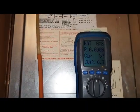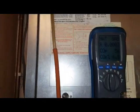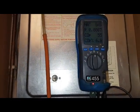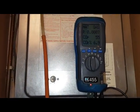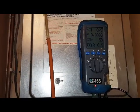So now you can see the reading taken from this flue sampling point. That's how you do your gas analysing without sticking the flue analyser in the flue, which can come in handy for different situations like this.